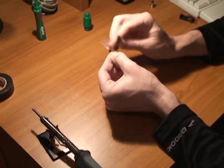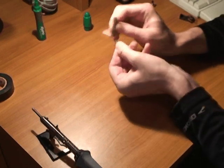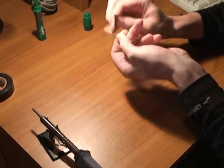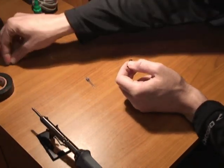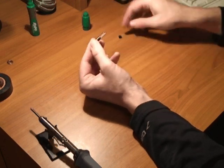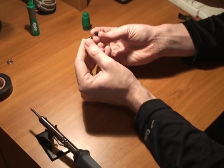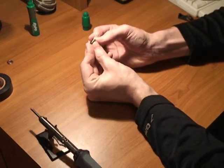With a fine piece of sandpaper, scuff up the surface of the LED. This helps diffuse the light to improve tracking. Remove and discard the nut and washer from the LED holder. Put the LED stems through the LED holder and slide the rubber plug onto the stems until it's tight. We put the LED on the outside of the LED holder so more light shines out to improve tracking.